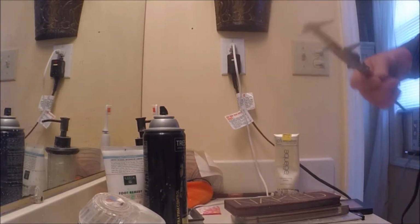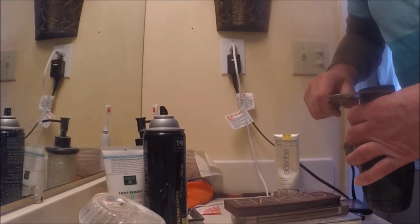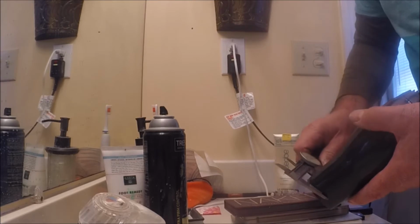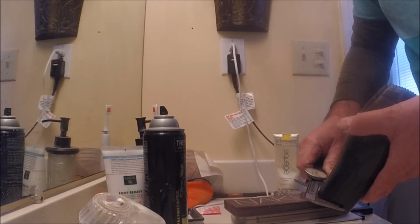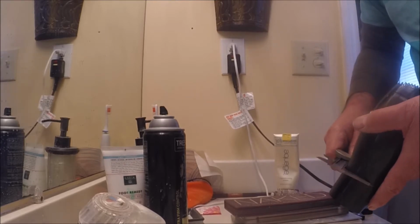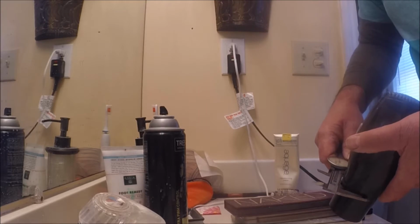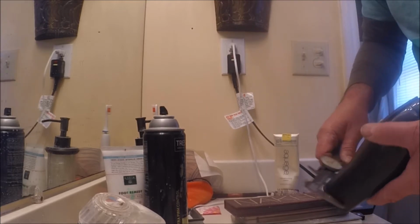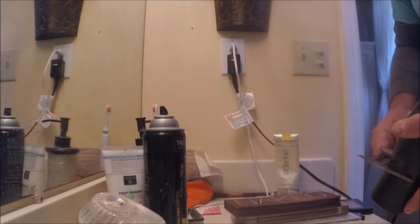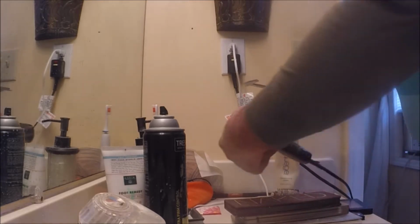So the first thing you want to do, and I got my older calipers out, is just to figure out how big a diameter of a hole we need. And see, all this stuff is plastic. Well, if I chuck it down here, it's a little over 2 inches, 2 inches 50 thousandths. If I chuck it up here, right in here, let's just say, it's 2 inches and 1/8 right along here. So I really want to get up into here so it will set there. So I'm thinking right here about this transition would be a good spot to ride it.